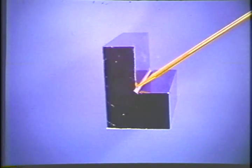The machinist is not called upon to grind a vertical surface as often as he is to grind a horizontal one. But on occasion, it will happen, and when it does, he must use all his skill in making the setup. The first attention must be given to the workpiece. The corner between the adjacent horizontal and vertical surfaces must be relieved in order to provide clearance for the edge of the grinding wheel.